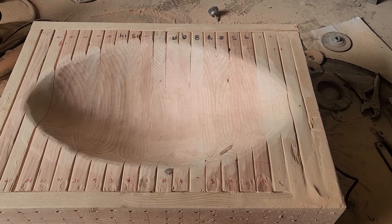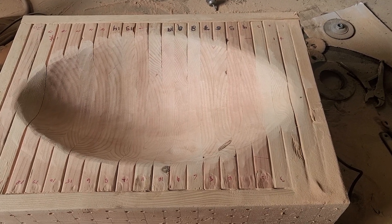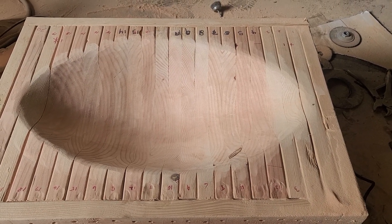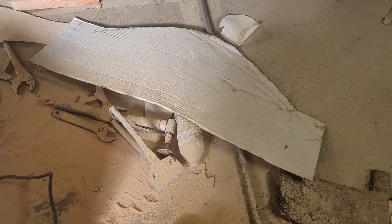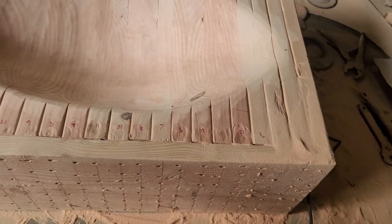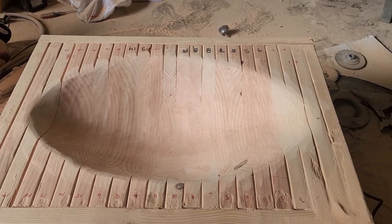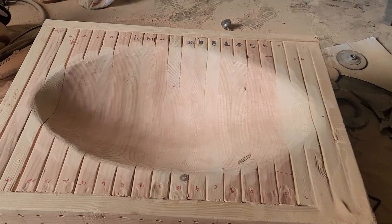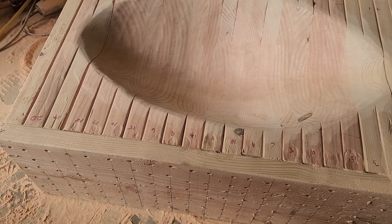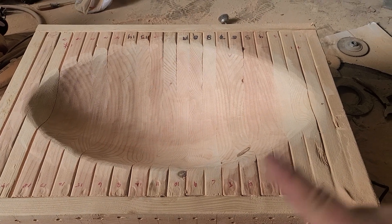This is my shrinker facilitator. I paid a dollar to watch Ray at ProShaper.com and this is how it came out. I made up some templates and nailed all these things together with some ring shank nails, and reinforced it with some screws just to hold it together. This should not move. It's made out of 2x12 — there are about 20 boards inside here, and then we have the frame on the outside.